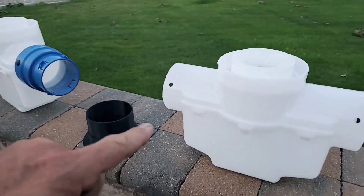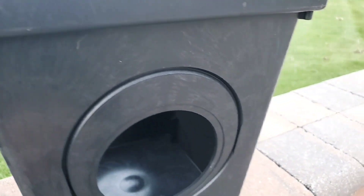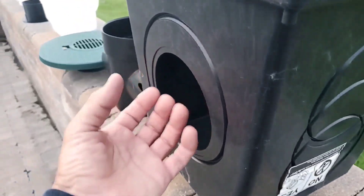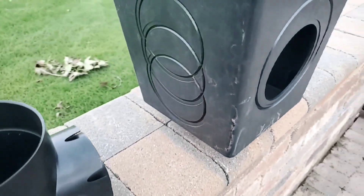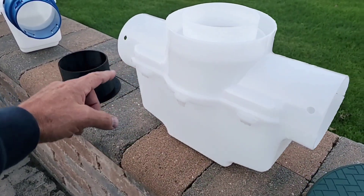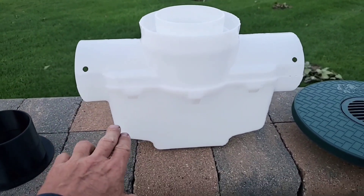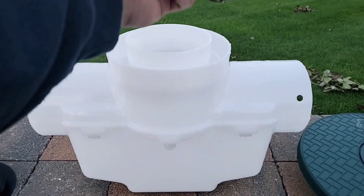This is going to have a larger gap than a 12x12. When you put your pipes together with a standard basin, the pipes are sticking inside the basin, and when you look down inside and measure the gap you're shooting, there ain't much of a gap once the pipe is inside. Contractors doing this for a living know exactly what I'm talking about. With ours, the pipe hooks up out here — it's not sticking inside the basin. We have a longer gap, so sediment in the water is going to fall and collect in the basin. You're going to catch it all and not contaminate your system. We shaped it so sediment concentrates to the center.